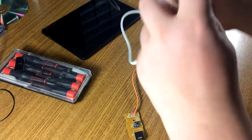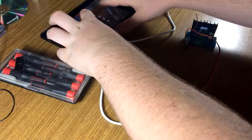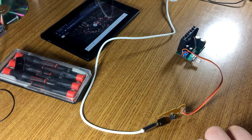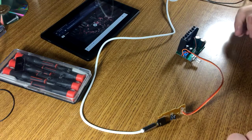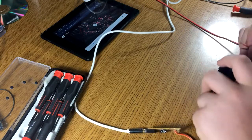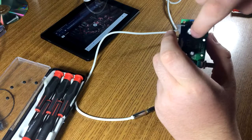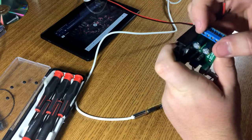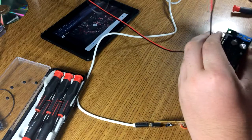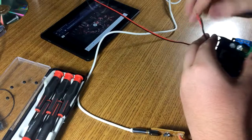So I have the horribly outdated Kindle with some YouTube-safe music. Now, this has only got one speaker output, so we'll hook up one speaker. The audio out plus and minus is kind of tricky to see because it's right down here between our terminal block and our cap. I also just noticed this is actually two separate terminal blocks, not like a solid four. I still say the terminal blocks on this TDA board — TPA, my bad — are the best blocks I've ever seen in my life.